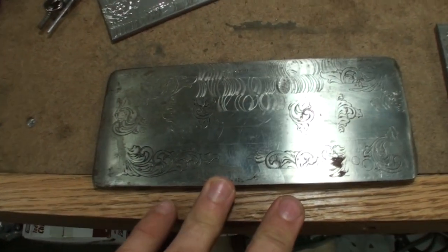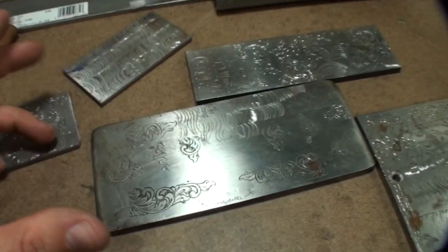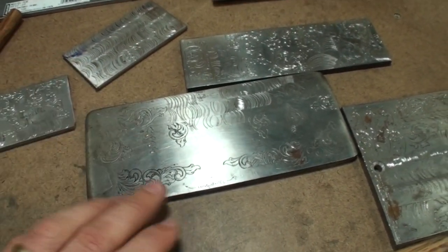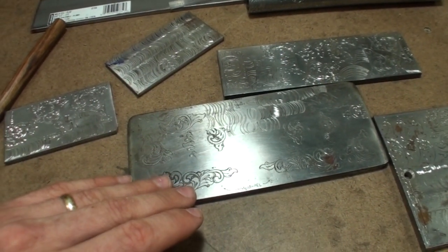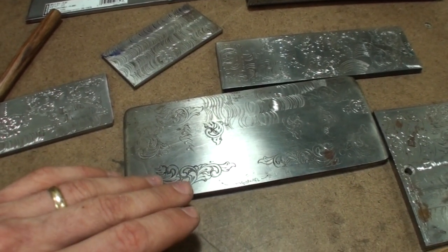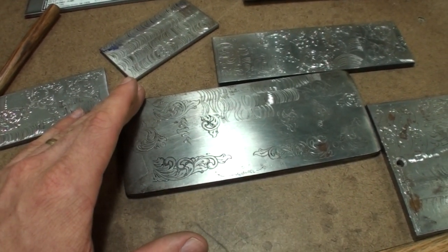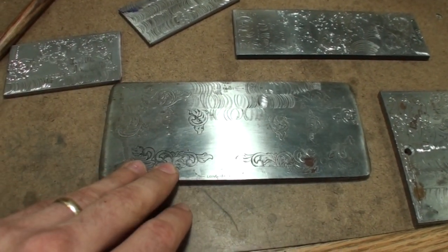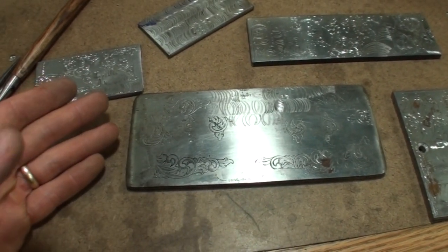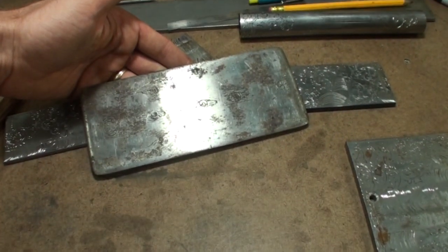So for example, this right here was a pull plate, meaning that after the gun was prototyped, and say there's going to be several of these guns that are all engraved the same, you can cut these designs on a flat piece of metal like this. And then if you have engravers working for you, those engravers can take pulls off this plate and transfer them over to the firearms, for example. And so this always stays the same, so you don't need to take the pulls off the actual engraved item itself. You have the pull plate.